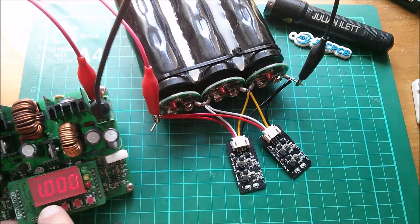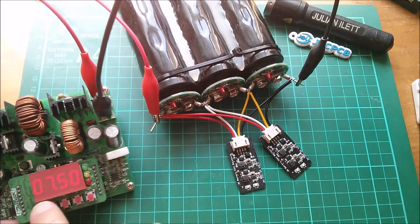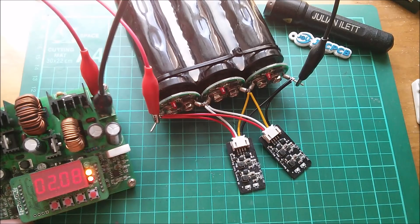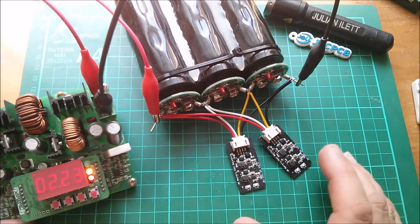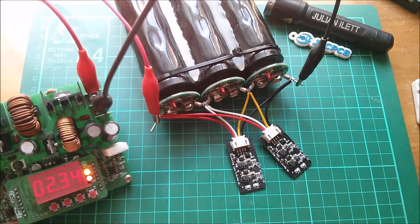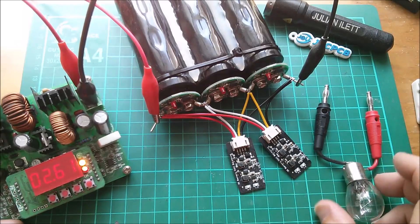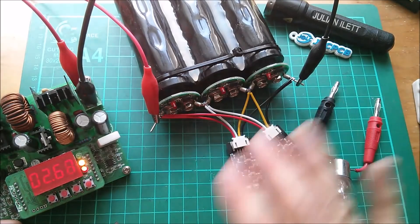I've set the power supply to one amp and 7.5 volts — 0.996 amps, so I'll watch the voltage gradually come up. It's pretty stuck at two volts but should start to shift. These balancers work okay at 2.5 volts per cell, so we're looking for about 7.5 volts total. I also have a bulb with banana plugs which I'll use to discharge one of the capacitors more than the other two — that should trigger charge movement between cells.